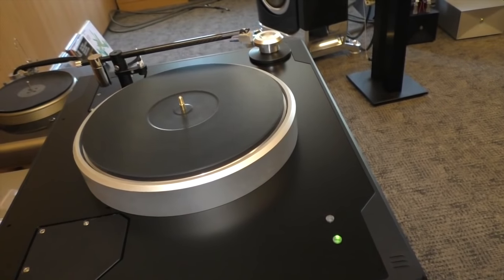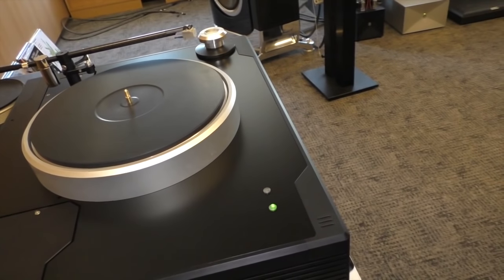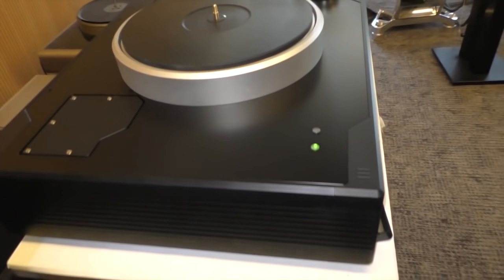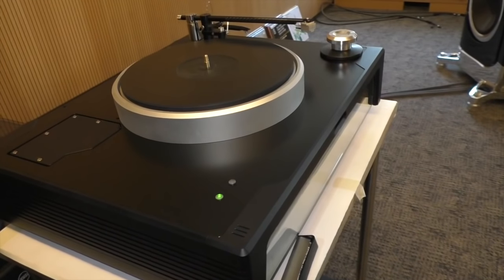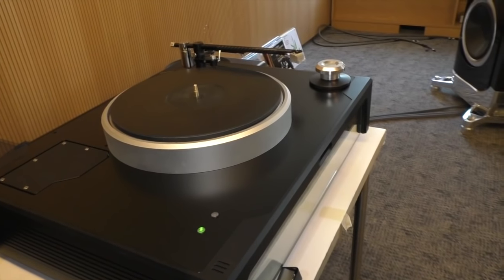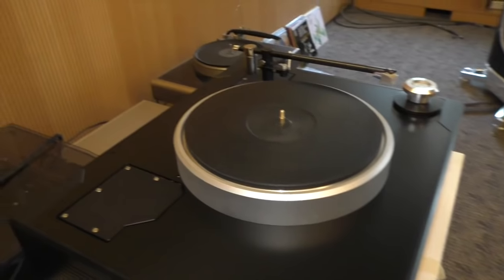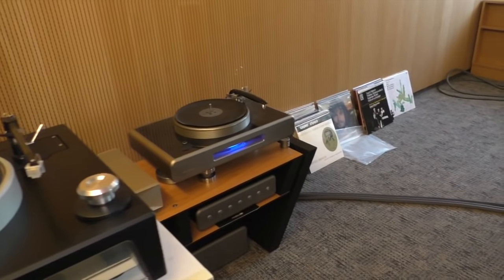Yeah. So who does that? It's done with a USB interface on the back of the controller. You connect your PC, and you just change a number. It's a four-digit number, so we're adjusting it within 1/1000th of the RPM. And so that's something you don't want the end user to deal with until he needs to, and then you would tell him. If he needs to replace the belts, there is a reason for it, so it's better for somebody to actually check it and see what's happening. Right. Okay. We provide the tool to the dealers and show them how to do that.